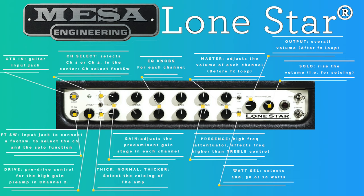Then we have a sideways 3-position toggle switch that determines the status of the incoming AC power. The Lone Star incorporates a built-in variac feature that enables us to reduce the line voltage. In the Tweed position, we obtain a spongier, scoopier response and allows us to power-clip the amplifier at lower overall volume. Another bonus is that in the Tweed power setting, tube life would increase substantially.